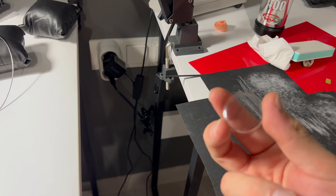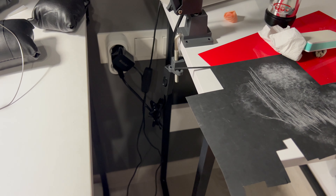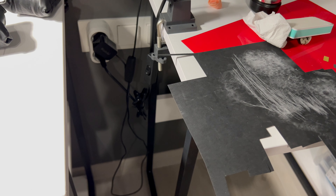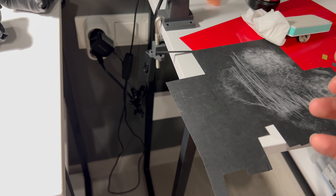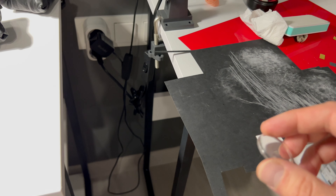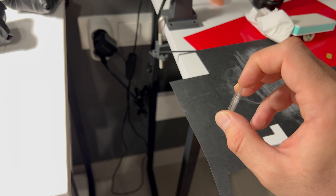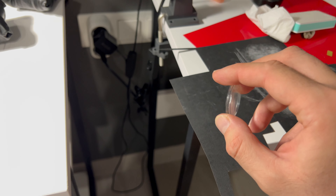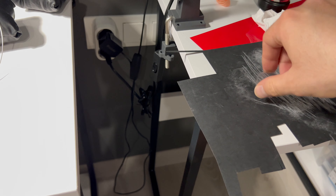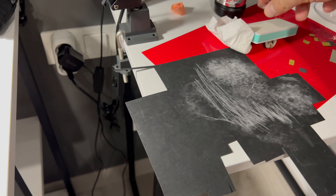Make sure there is about a 0.2 millimeter section with an entry angle — that way it will smooth the crystal in. With this method in mind, I also remembered another idea: I have an extreme amount of 5118 crystals and they are basically identical to 5022, with the only difference being the armor ring area height. So the idea is to uniformly shorten the crystal and then polish the underside.